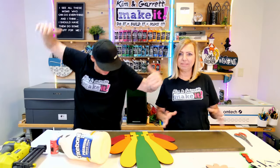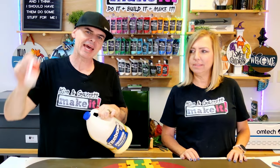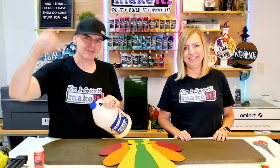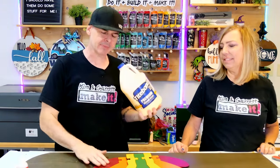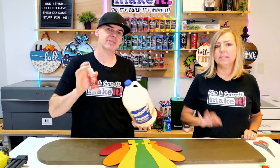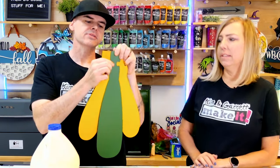Step four: we're gonna bring it all together with a little bit of wood glue, a little bit of Starbond, and maybe a half-inch brad nail — the nail, not the guy. We're gonna use the wood glue to attach the MDF to the wood, and we're gonna use the Starbond to attach MDF to MDF. And for my tail feathers, so that we didn't have to paint many lines, I made little puzzle pieces that fit back together, and then we'll pin it to the back.